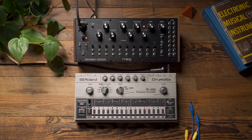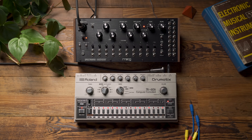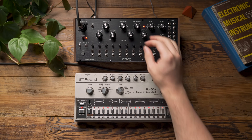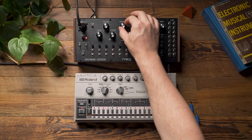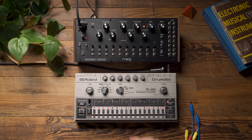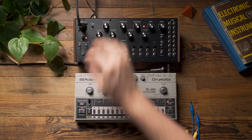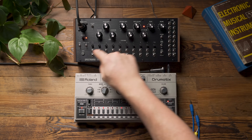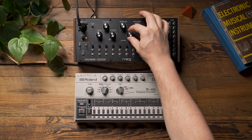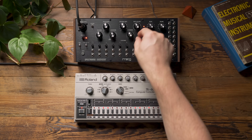Most interestingly, I can take the spectrum of all 10 bands and shift around where they're focused on the oscillator's signal — it will move all 10 bands in parallel. There are lots of interesting combinations to find between the VCO frequency and the spectral shift position. I can also increase resonance on all of the bands to add a more metallic quality to the sound, and spectral shift will have a much more dramatic effect with high resonance settings.